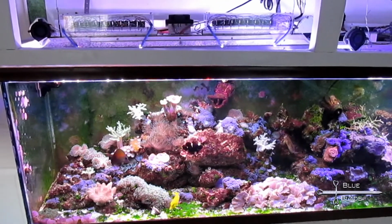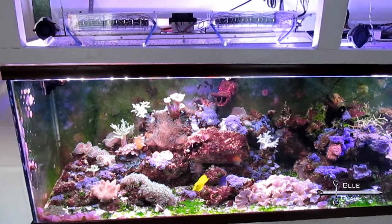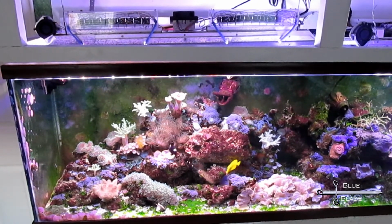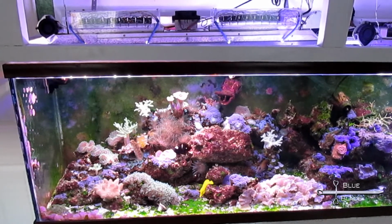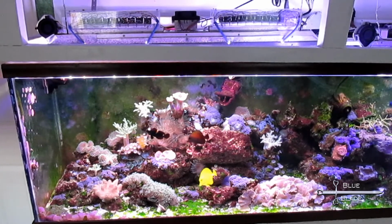Since building these, I've made a bunch of mistakes. Call me Electro Boom Jr. Apparently, if you accidentally put 12 volts to the PWM line, there's a nice big bang and the magic smoke comes out. Then you have to replace a dozen drivers or so. Don't do this. And really, don't do it twice.